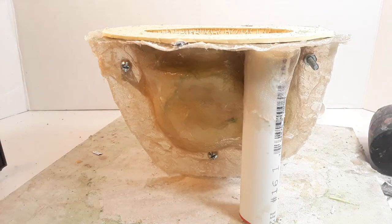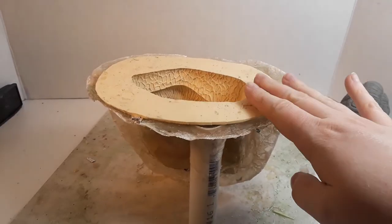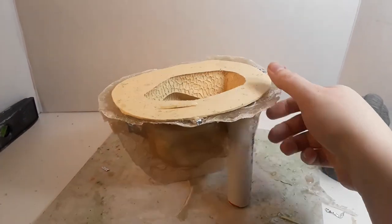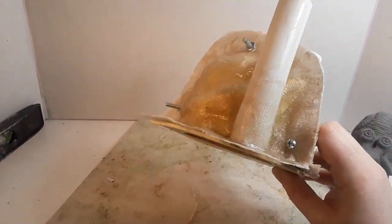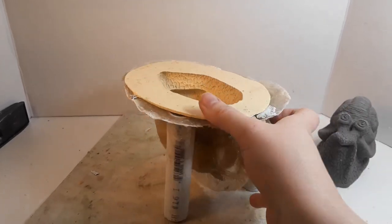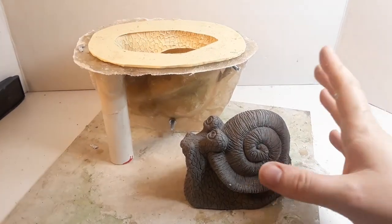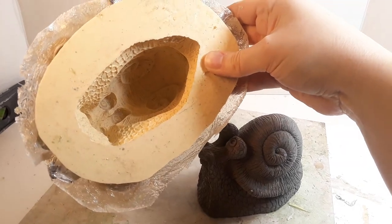That's the last leg cut — I'm going to flip it over and see how it looks. It's nice and even, touching on the back part of the mold with the pipe as the two front legs — three points of contact. The mold is all finished, bolted up and ready to go. It's nice and even when flipped upside down and ready to be poured. I usually pour plaster for my first piece to keep an original, which can be molded again if the mold eventually breaks or gets damaged. I hope you guys enjoyed this video covering all the steps for mold making for concrete statues. Please like and subscribe — thanks!